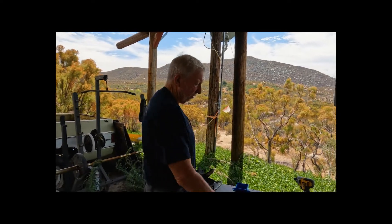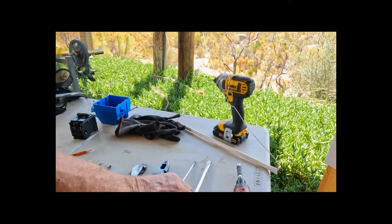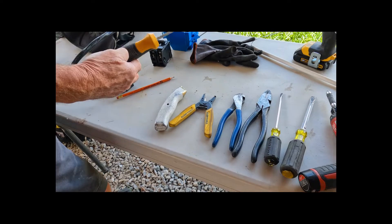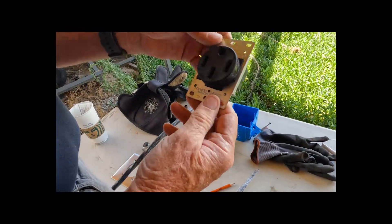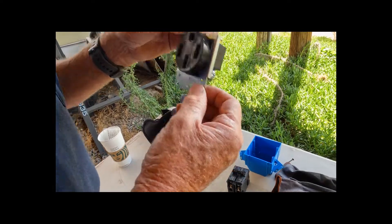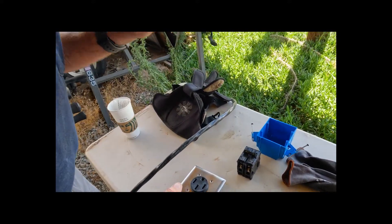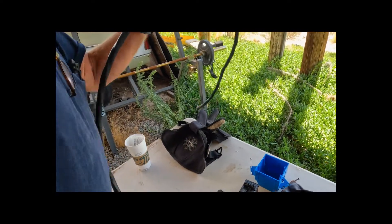You can do a plug in your garage with minimal tools. I like the Milwaukee electric screwdriver but you don't really need that. You need a couple screwdrivers — probably a Phillips — also your lineman's, your side cutters, your strippers, a knife, and a drywall saw. Here is the Tesla-rated plug; the actual number is 14-50R. We're going to show you other uses for this plug, and here's the stainless steel plate to finish it off in your garage.